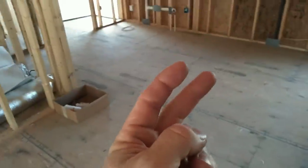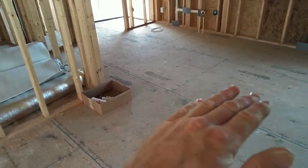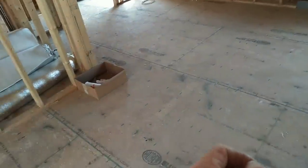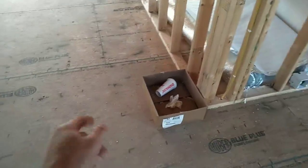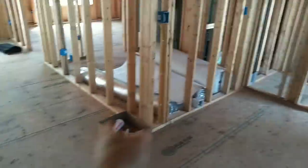This home usually has about a five-foot wall here, four feet high, going across. The contractor on his last two houses hasn't done that wall, which tells me he's going to do a peninsula. I'll put an outlet at the end of the peninsula — there's a wire coiled up underneath the house for that purpose, right here.